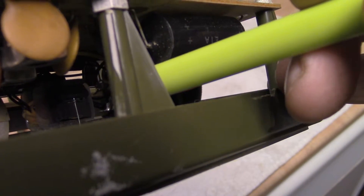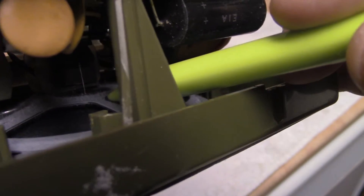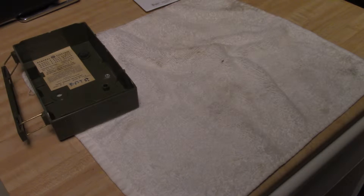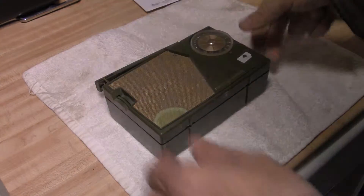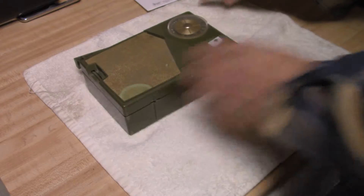If you look down through here, see this little wire right there? That's the speaker. And if you notice, those two wires — this looks like a little baby coil. This radio has a field coil for the speaker. It's not permanent magnet, even though it's a pretty small transistor set. It's really weird. I'm not sure why General Electric did that.